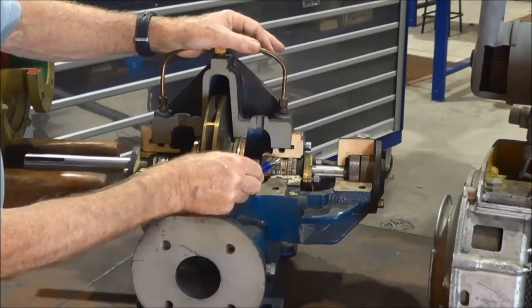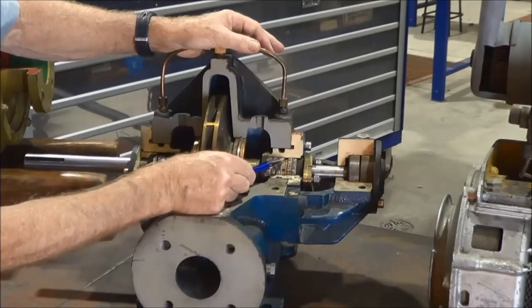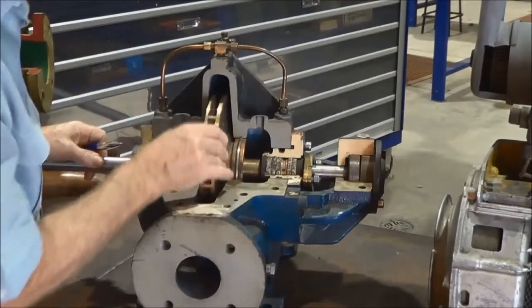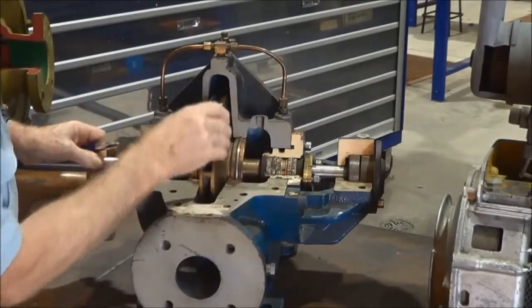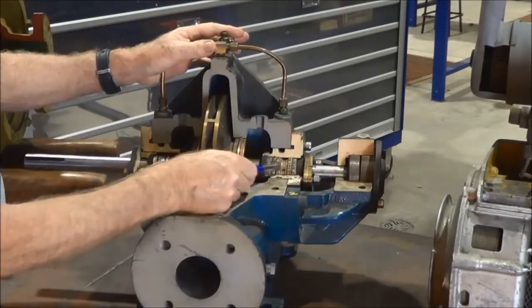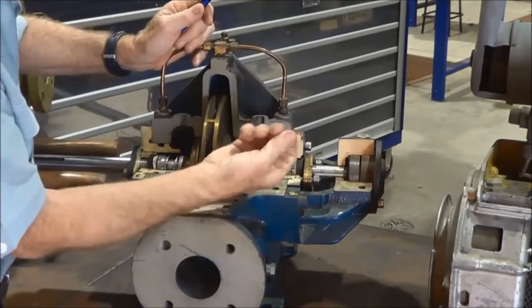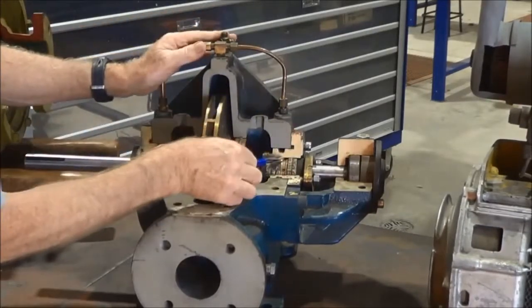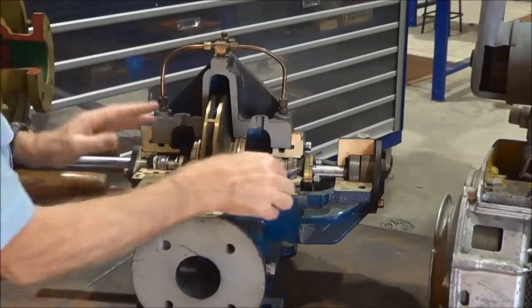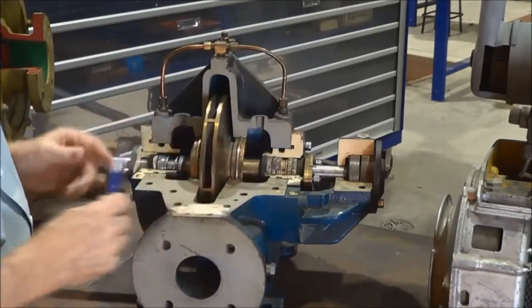What the lantern ring — or what the gland — is trying to seal is water trying to escape along the shaft and water trying to escape around the packing and down through the stuffing box. As water comes from the lantern ring and forces its way back along the packing, it acts as a wet seal. The water coming through there also serves to cool down the pump, because it can get quite hot, especially if the packing is dry and has been used for quite some time. It also acts as a lubricant — the packing does have grease impregnated into it, but as that dries out you've got the water there to help lubricate it too.